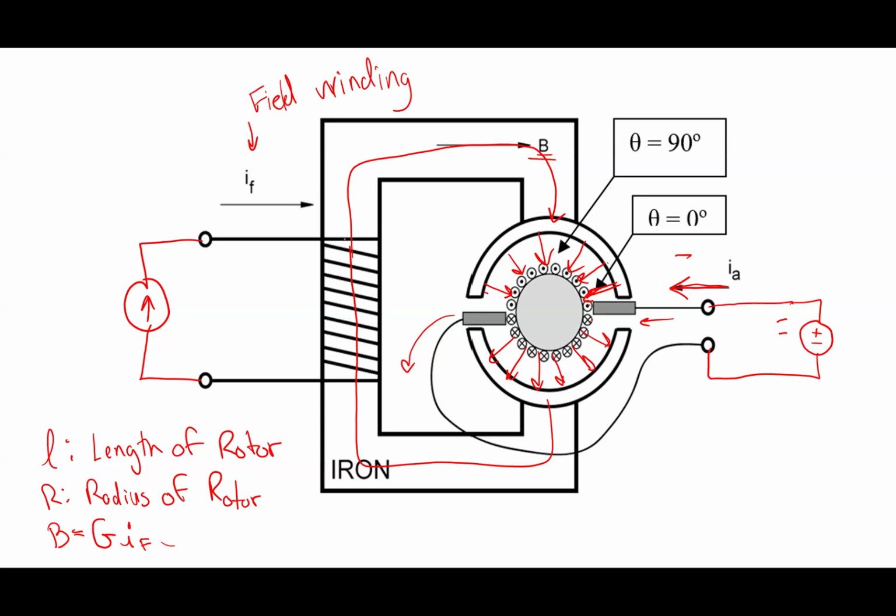All right, now, there's going to be a force on those wires, right? So if I think about this, force is IL cross B. So force equals IL cross B, where the B, I'm going to say, is just the field that's going around this thing. So somehow that B field is proportional to whatever that current is. Now, one thing I want to think about: if I told you this is a cross product, how do you figure out the magnitude of a cross product? How do I figure the magnitude of F?